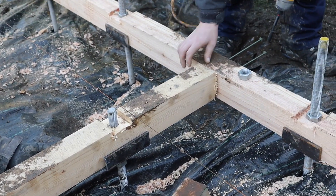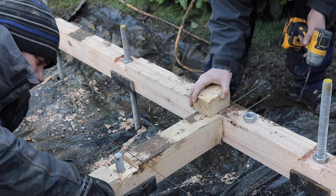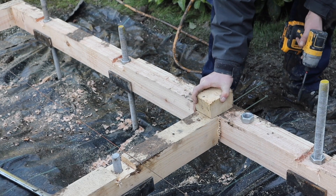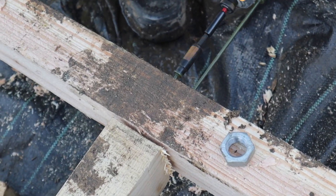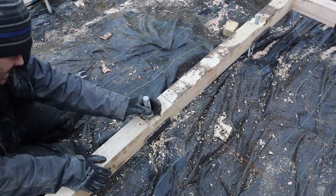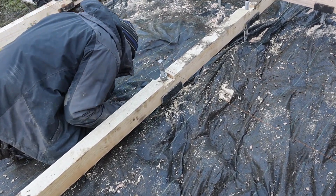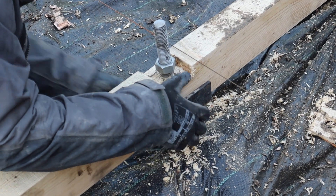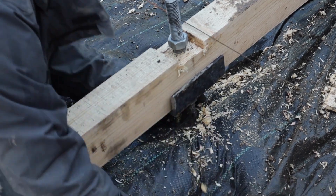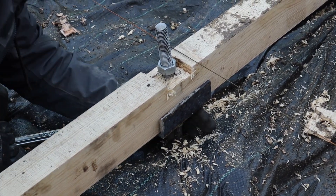Look at that now. Simon, you're higher there — just lower it down a little touch. That's just skimming the line now. What John's going to do is work his way along and wind these up to meet the string line, because this timber that's arrived is like five or six mil smaller than the rest. It happens sometimes but it's easily got round. That's the base on this one finished.